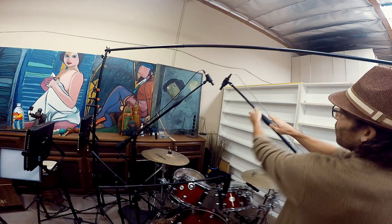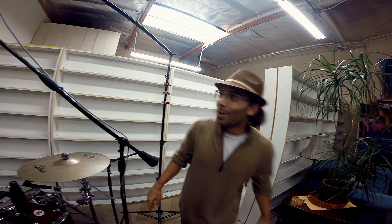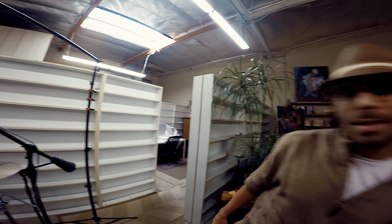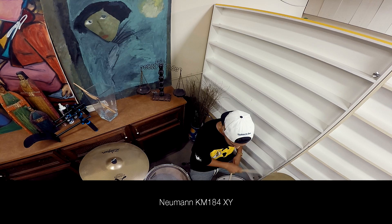The initial hit is definitely in phase, and then it kind of deviates from there. Now we're going to hook up the XY. Why? Because XY is going to give us less phase issues. We need to get these exact — we're trying to make that right angle, that perfect little V right there, 90 degrees. That looks like about 87.5 right there. This could be pretty slick and suave. Let's put it into action.